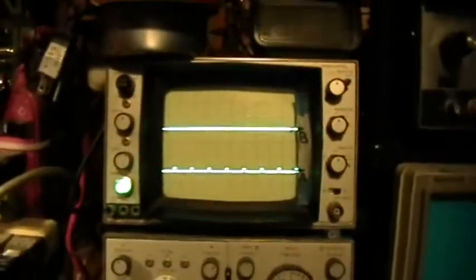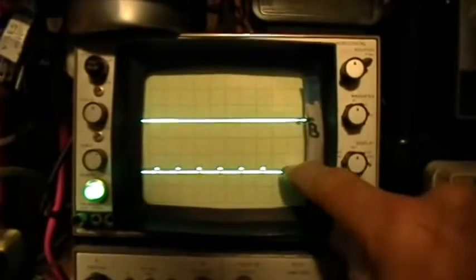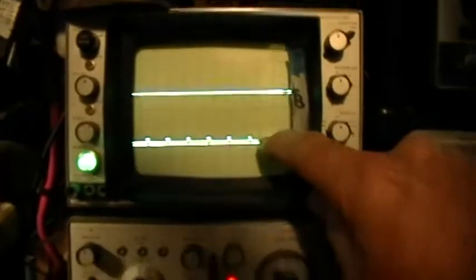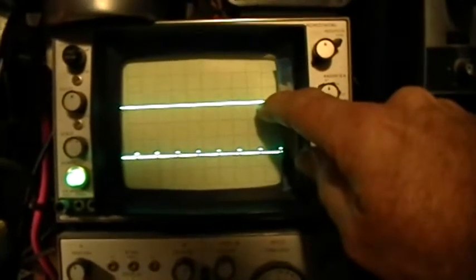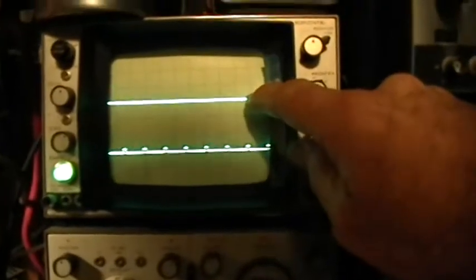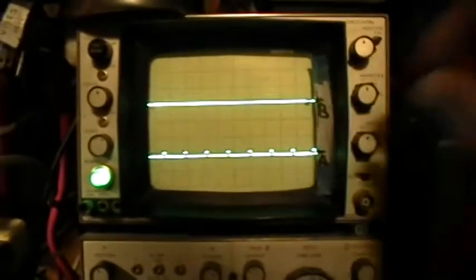I've discovered that there's another easier way to do it that actually cracks me up, man. Okay, so anyway, if I turn up the function generator amplitude right here, this is at 5 volts per division on the gate drive signal, and this is at 2 volts per division on the current viewing resistor trace. Very similar, the same settings that Ainslie shows.